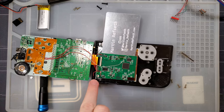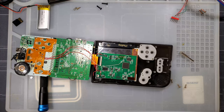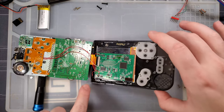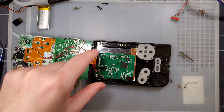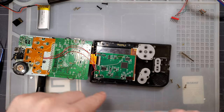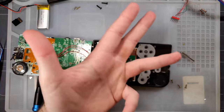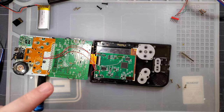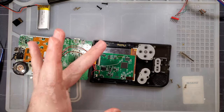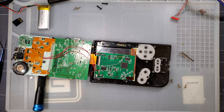I did go ahead and add in the extra touch pad here — I never did that in the first half of the video. It's literally just a little bit of copper tape attached to a wire, soldered into the shell. This gives me full control. This firmware is designed around having five inputs, and when I originally installed this kit I left one out, so I only had four inputs. This last one is for quick-changing the color palette, so you don't necessarily need it. And of course you can program the inputs any way you want.